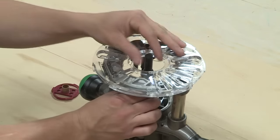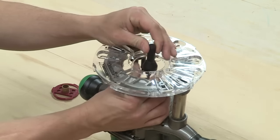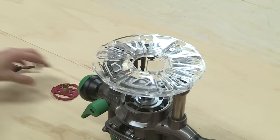After you've finished installing the turn lock base plate to your router, remove the turn lock bushing and centering pin. The bushing is only used for centering.